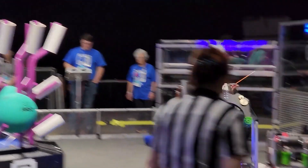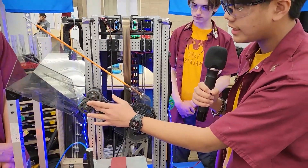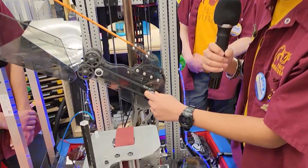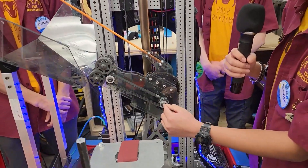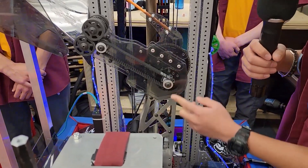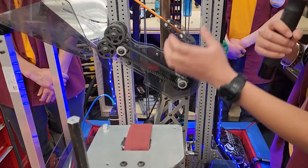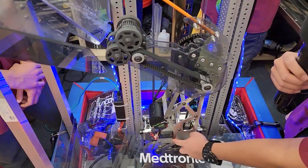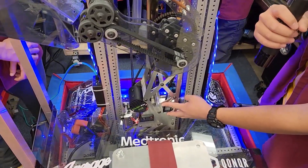Going back, this is our coral scorer. It's kind of like a Rembrandt-style intake and outtake. We have a coaxially driven pivot — a max spline going through that controls the up and down movement, and then a hex shaft going through the max spline that controls our intake and outtake. That allows us to spin the arm 360 degrees and really lowers our center of gravity. Instead of having the motor on the arm itself, the motor comes down here next to the carriage, contributing to our design philosophy of maintaining a low center of gravity.